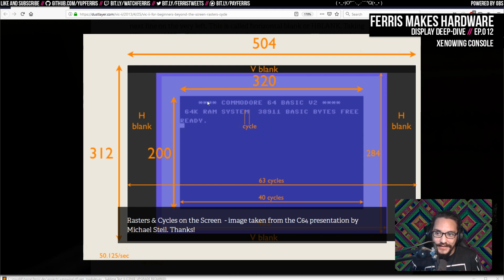And again, that as well is just the same kind of idea where it loads the graphics data into an internal buffer, and it also displays out of that same buffer. As long as the loads happen before they're being displayed, that's fine. And the only reason it does that in an internal buffer in this case is so that it only has to do it once every 8 lines, so that it can free up the CPU to have access to the bus for the other 7 lines, which similarly to the reason why we're doing buffering, in fact, is exactly the same.